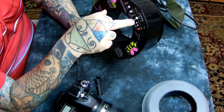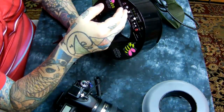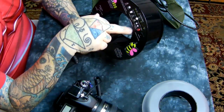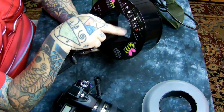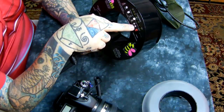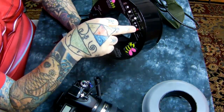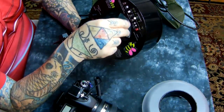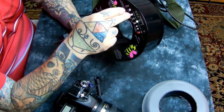If you press the third button — cycle — it means that after you fire, the modeling lamps will not come back on again until it is recycled. Here you have a full recycled display light. This is a dump light for if you actually drop the power — you can dump the last charge or do a test there. It's indicating that you've dropped the power from where it was previously and it's in mode to dump the capacitor charge.